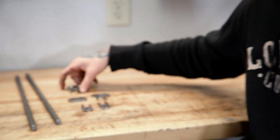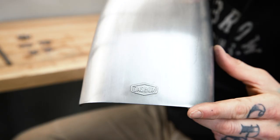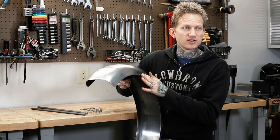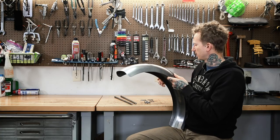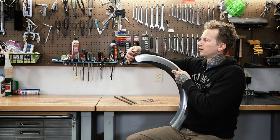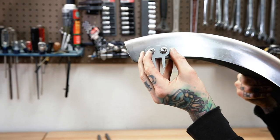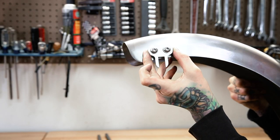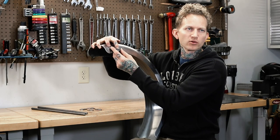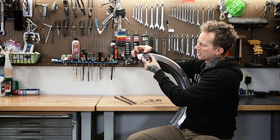and clean. The reason for this is on a fender such as this gas box fender for 16 and 18 inch rears, it's got a really nice sidewall for it, and this lends itself very well to this 2.0 style mounting kit. The idea is you would weld the 1/4 inch thick oval style tab to the fender, and that allows you to unbolt your strut and then bolt it directly to the fender without having to fiddle with through bolts and nuts. I can illustrate this here with the one that's not bolted together.